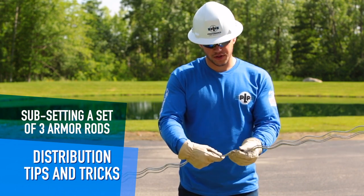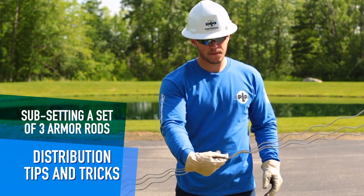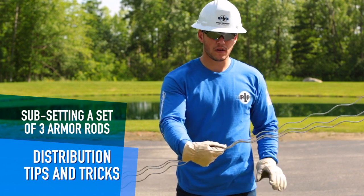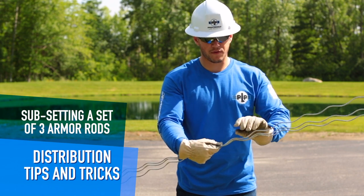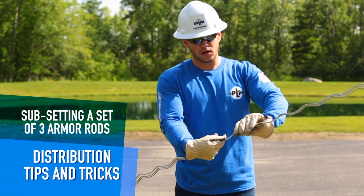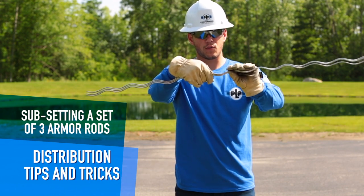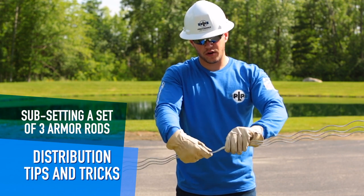What you're going to do is take your right hand, lay it underneath the armor rod, and hold them in phase. You have to pinch it, hold it firmly, but don't have a death grip on it. You're going to take your left hand, turn it over, and lay it one pitch length away from the armor rod, right on the color marks, and you're going to start to roll.